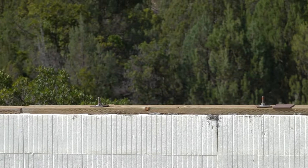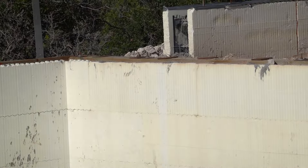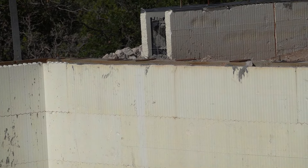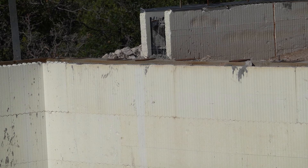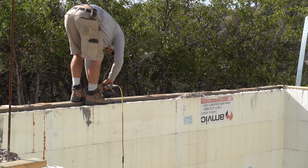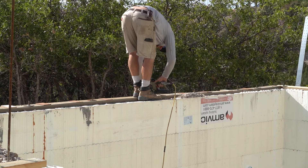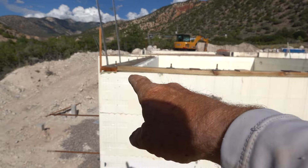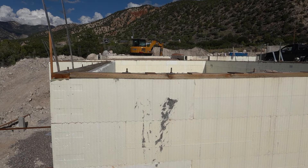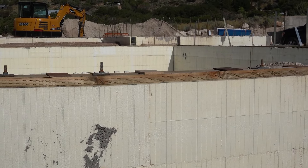I've got a couple on that back wall just leveling it out. The other bad spot had about a quarter-inch dip, so I'm going to take a finish brad nailer and nail all those shims on. I'll have a perfectly lasered floor. Here's a better view of a big dip — you can see I just shot those on to flatten it out, and those are my layouts for my joists.